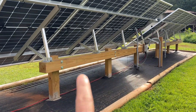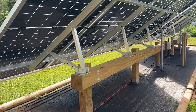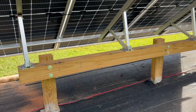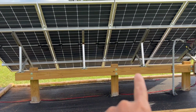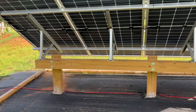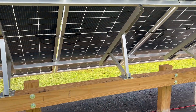The way I did this is I put three posts — those are four-by-six posts — and then I run a crossbeam, which is a six-by-six post that's 12 feet long. I did that so I could line everything up pretty straight; it was easier for me that way. I know other people install this using one post per leg, so they'll have a total of four, and some use concrete and some use six-by-six. I used half-inch by ten-inch carriage bolts — very strong.